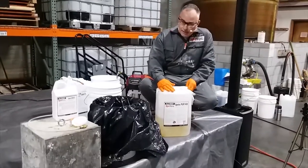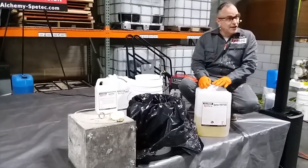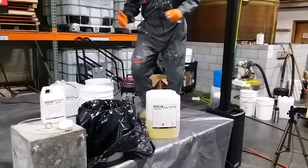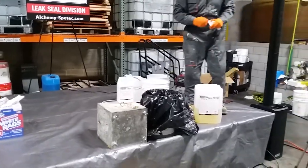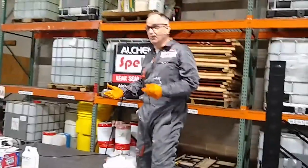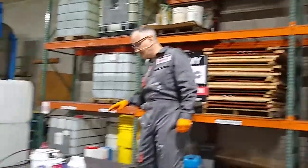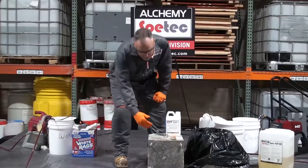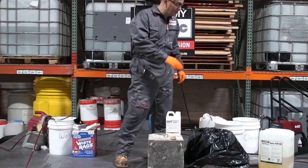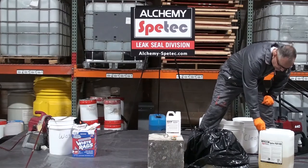I'm going to start off with half catalyst. You can do 10% or 5%, or any ratio in between. This is not like an epoxy — at 10% activator it goes off the fastest, at 5% it goes off slower. For crack injection, we typically start off going slow because we want our product plenty of time to penetrate. If we have high flows or very cold water, we may increase the accelerator. We go into more detail on this in our crack injection theory video.